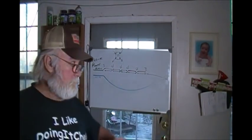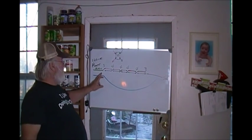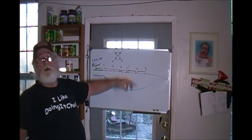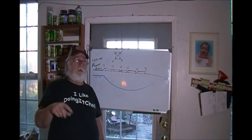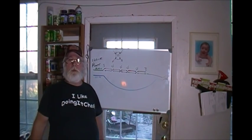So, remember this white wire is actually running along in that Romex, and it's in the switch boxes, and you're just tying the white wires together as you jump across. If this is at all confusing, go to my three-way wiring circuit video, and it'll go into more detail as far as the wires and how they work and all that kind of stuff.